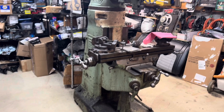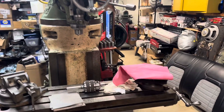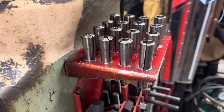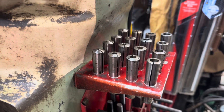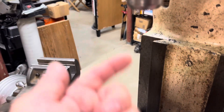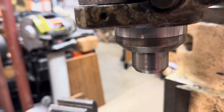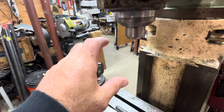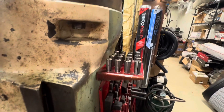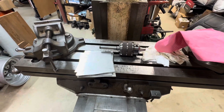It's the original three-phase motor, only half horsepower — these are limited. It only has about three and a half inches of quill travel, and the quill is set up for a number two Morse taper, so the largest collet you can put in there is half inch. I have an ER32 collet adapter coming — it's a piece that goes in and balloons out so you can use bigger collets. The ER32 is about half the length of these long-taper collets, and when they arrive I'll show you.